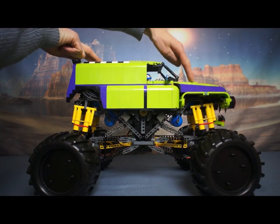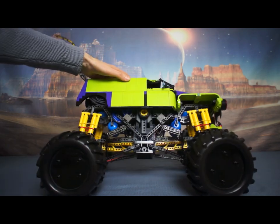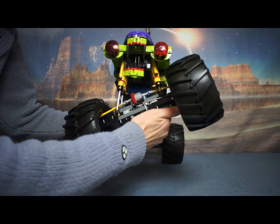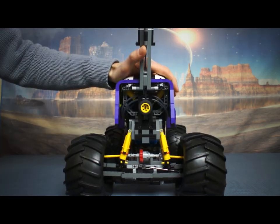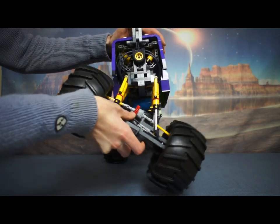The pneumatic cylinders have had the thick LEGO grease removed, air ports drilled out, and thin silicone oil added, but the oil seems to cause high static friction or stiction. Here you can see the suspension travel and how the tyres, drive shafts and cylinders all avoid each other. With the rear suspension, the tyres are not touching the body shell or causing any collisions, but they're slightly too sticky.